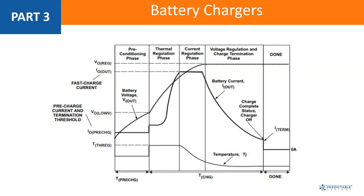Because there are different phases that you have to go through when charging a lithium battery, you can't just supply a power supply and a resistor. There are some parts of the charging phase where the current is being controlled. We've been looking at situations where you're controlling the output voltage for a voltage regulator, but when charging a battery there's a part of the phase where you're regulating the voltage going to the battery, and then there's a part where you're regulating the current going into the battery.